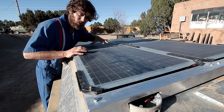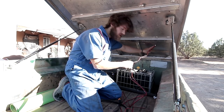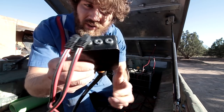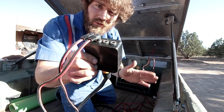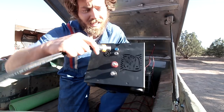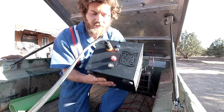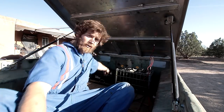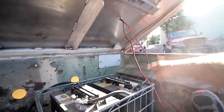With two wires, all four of these solar panels are connected. The wires run through the hole in the roof of the aluminum cover and they plug into this four-port connection box. This allows you to connect up to 12 solar panels — three in a row, four different plugs, 12 total. On the back side of this connection box is one wire which then feeds to the back of the Kodiak in this port right here. Just like that, I now have four solar panels recharging this solar power generator. The easiest setup — all you need is four things: the solar generator, the wiring, this connector, and the panels.